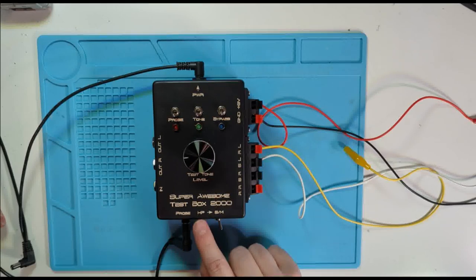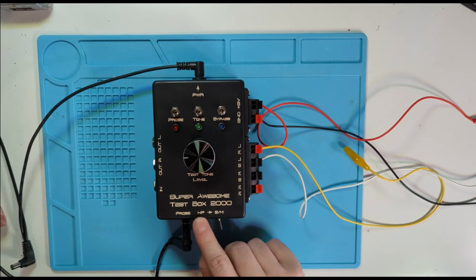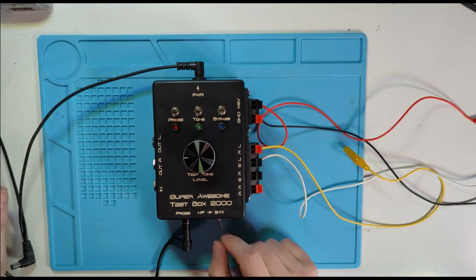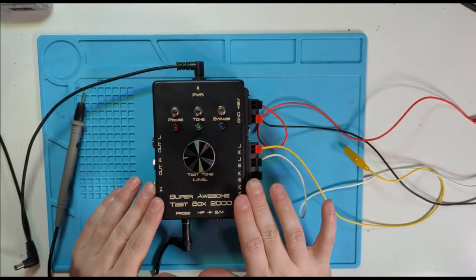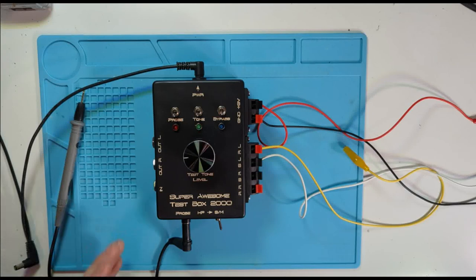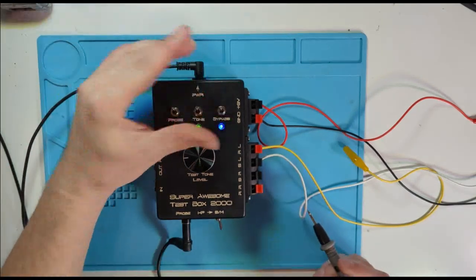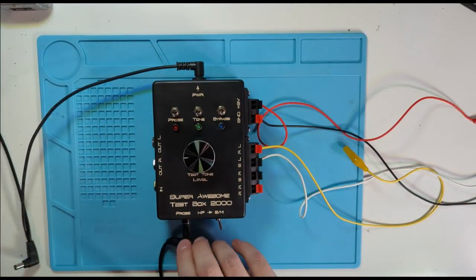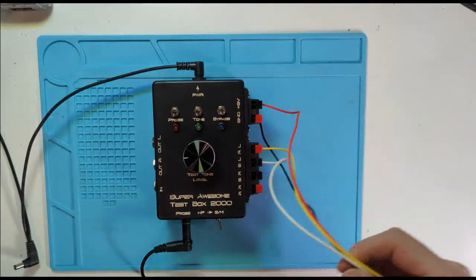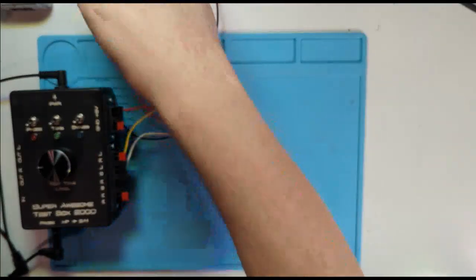The test box also has a 9-volt and ground connection, send and return connections on both sides, an onboard headphone amplifier, and a stereo/mono switch. The nice thing is it makes everything fully contained — when I have a test circuit I don't need any external connections. I just turn on the tone, plug in headphones, monitor while injecting the tone, and trace my way through the circuit. I occasionally have populated PCBs or kits available, but there are other test boxes online with similar features.